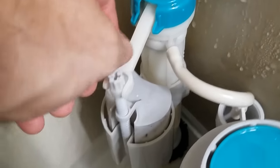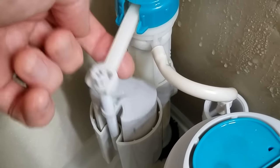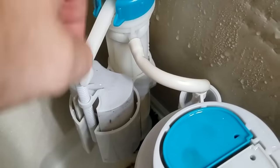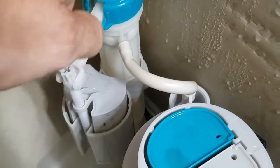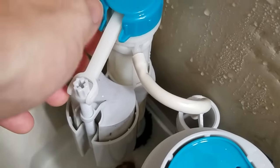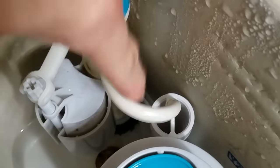If this does not go all the way down, you're not going to get the water turned on. If it's all the way up, the water will be off. So you need some travel in there. If you don't have enough travel, you can adjust this to make it work. This is more like fine tuning. The main idea is to adjust the height of this whole assembly.